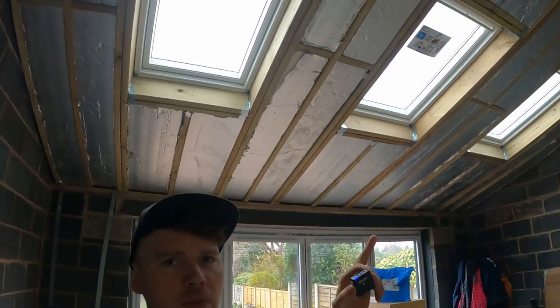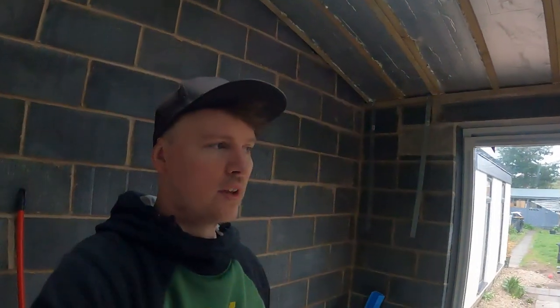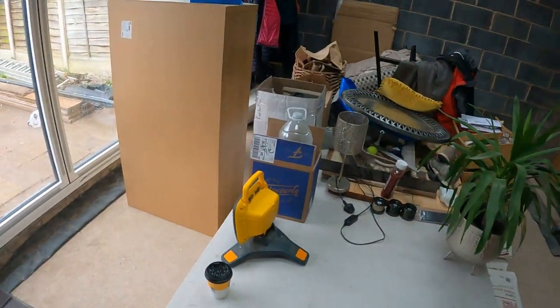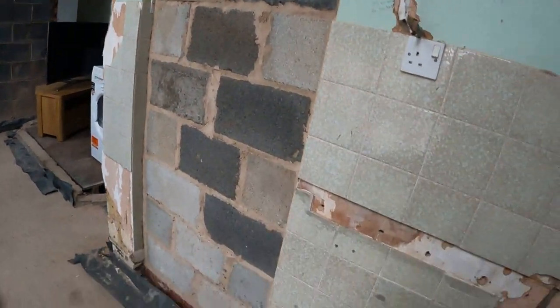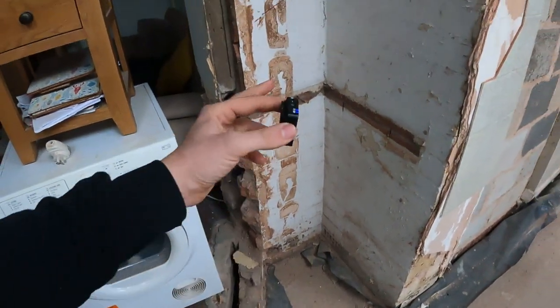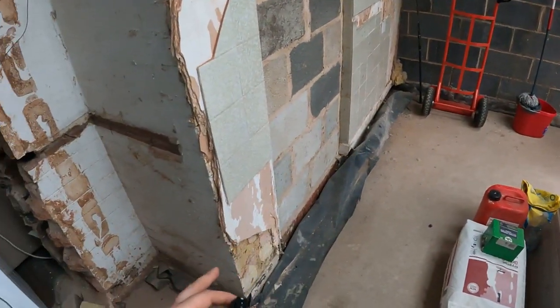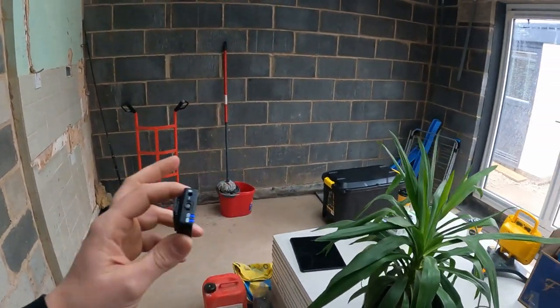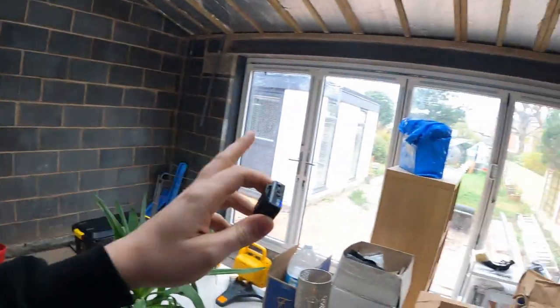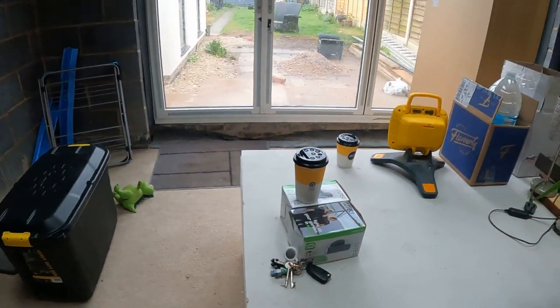Because the way these joists lay above me with the Veluxes, we want to be putting the downlight there, and the same matching across, because in the centre of this cross beam we're going to do a drop light and a drop pendant there for an island unit. We have got a lot of stuff in the way, which it is what it is. The first job is we've left a massive coiler cable up in that bedroom up there, so we're going to bring them down. The builder hasn't quite finished, and it's going to be a big void, blocked out. For the kitchen we can run low level across, either in conduit or clip direct - all on surface, within regs. We're going to have the oven here. We've got a Wren kitchen plan on the iPad - larder unit, cooker, extractor. We've got a ring outside, a floodlight to go up on the exterior, and two outside lanterns, up and down lights, which are customer supplied. So come along for the journey.